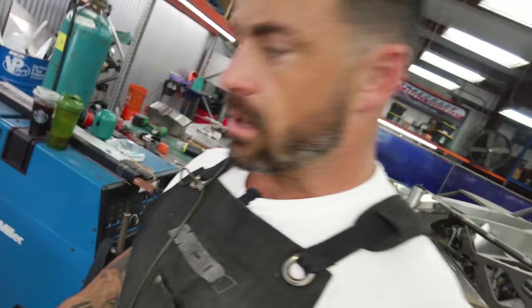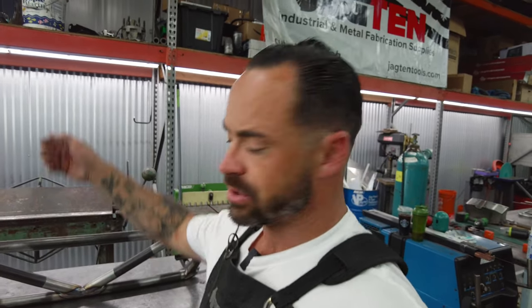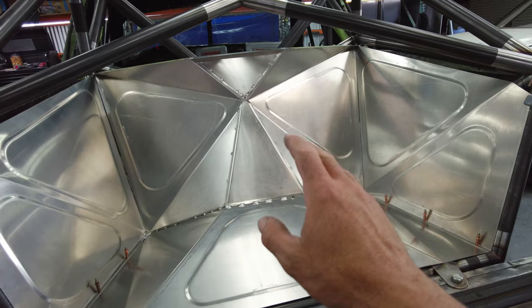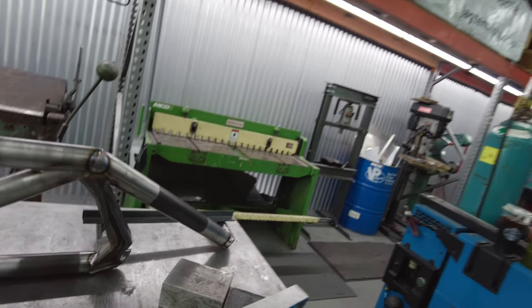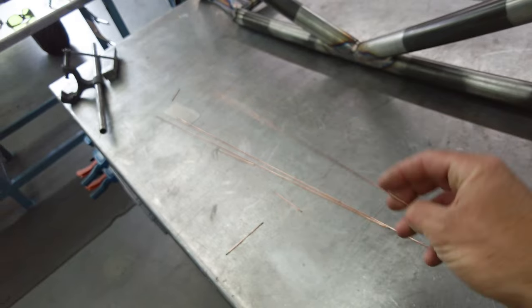A good habit is that there will be sanding and finishing done before we start the cover pass or the second pass. I'm going to go back and forth on those, so call it what you want. Anytime I'm building something, like this fuel cell, and it comes time to sand something and then weld it, or weld it and sand it, I try to clean the area because it dirties things up. If I'm finishing out areas and sanding and putting dust on here and I have rod sitting around, that's going to contaminate the rod.